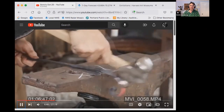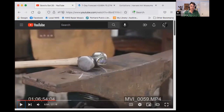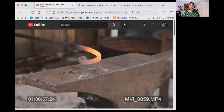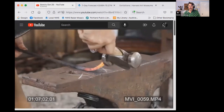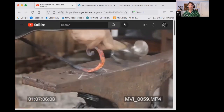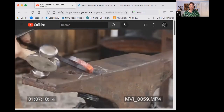So that's not ideal. That's got to be fixed. I'm trying to do it. I don't really have enough heat. Hit it on the kink. Not enough heat. So let's move on to the next heat so I can get rid of my kink. There's that kink. So now I just set myself up so I can hit it on the kink. Much better. And then I'm back to looking and deciding what I want this to look like and adjusting and tightening where I feel like doing so.